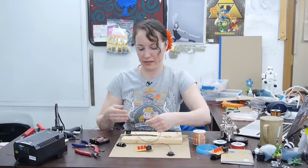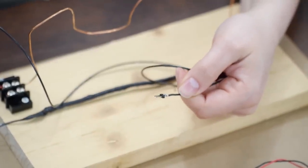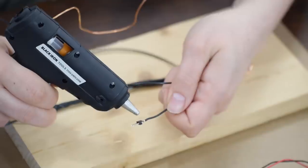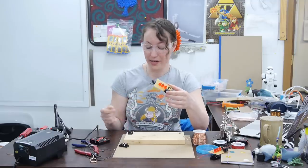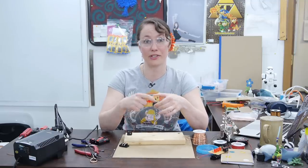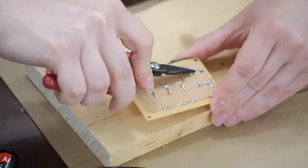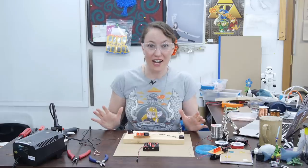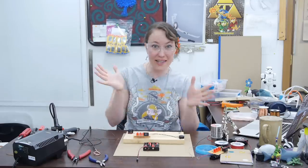At the end of the flexible wire connected to the wand, I have my male header pin that'll be used to connect it to the board, and I'm going to add some hot glue to help reinforce it. The last thing to do is take the wire that's connected to our wire maze and solder it to the center terminal of our switch. Everything's done — now we just need to plug in our battery pack and our wand and play our game.